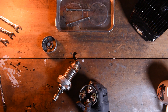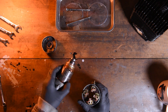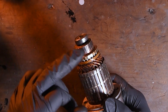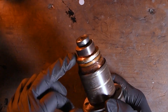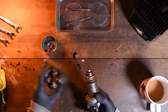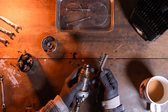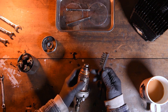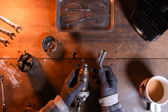Considering there's quite a lot of material poking out at the end here I'm pretty happy with that, and all I'll need to do this time is clean up these plates. As you can see this top piece up here is currently black — we need to remove all of that crap off of there and return it back to the copper colour it should be. Cleaning this all up will create a better connection between it and the brushes when it's spinning round. I'm going to use a brass brush; don't put too much pressure on this because you don't want to wear away the copper itself, you just want to take off that carbon surface.